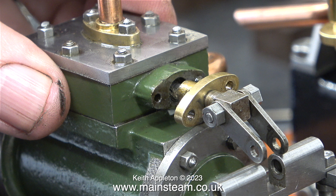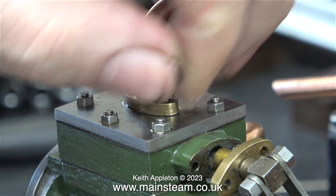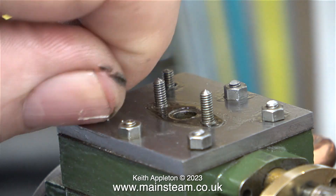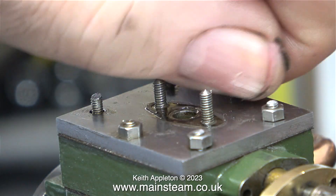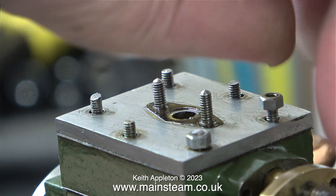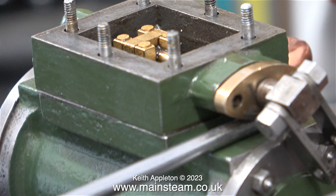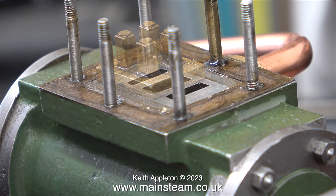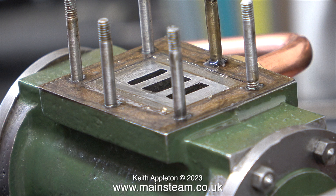In this clip I think you can see the remnants of some sort of valve packing in there — I'll look at this in more detail shortly. It's time to remove the steam inlet piping and also the steam chest cover. I've shortened the studs by grinding them but they really need proper machining; before reassembly I'll take these out, go up to the workshop, fit them in a lathe and clean them up that way. It would be nice to see them all nicely domed at the top. With the steam chest removed and the slide valve out, I can have a look at the ports.